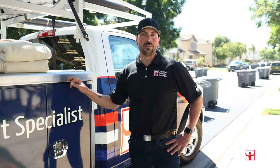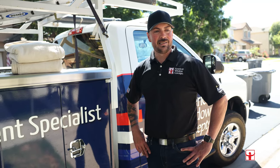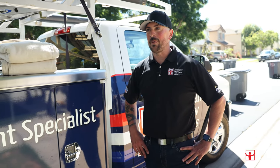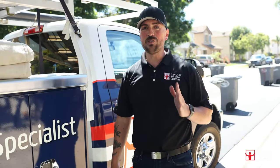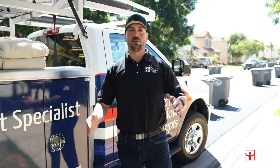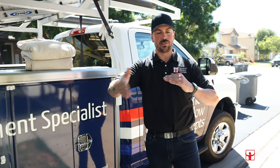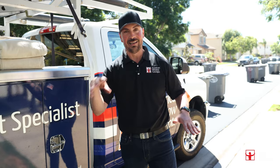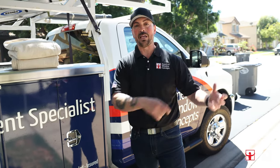Thanks for watching the video on how we would take on a French door. It's vinyl — it's an Anlin Malibu French door. They're pretty user-friendly, and it's really all about using the levels. If you don't use levels when you're pinning a door like that, you'll be in big trouble — doors rubbing on the bottom, or gaps that just look terrible. Use your levels. Always start with a flat base. With a French door, you don't want shims built up in the center where the frame at the bottom is crowning up — it gives you no ability to move the door open and close. I had that problem once when I first started doing French doors. I had to pull the door out, pull all the shims out, and just do the edges. I always do the edges only and then do a big buildup of caulking in the center.